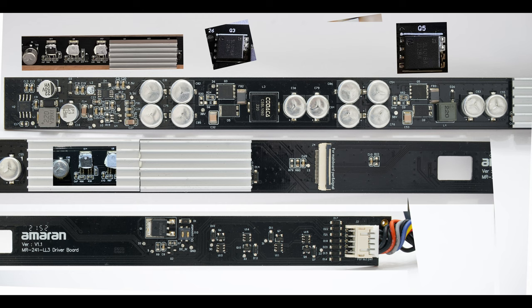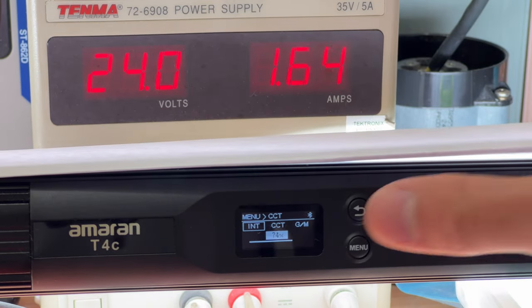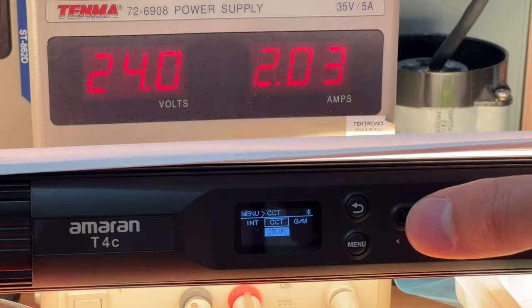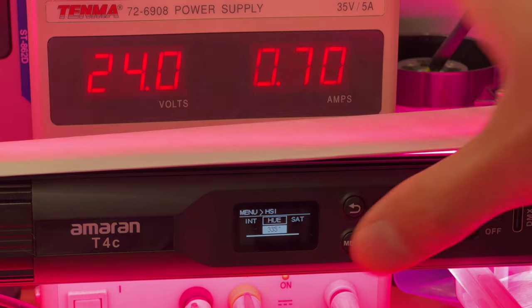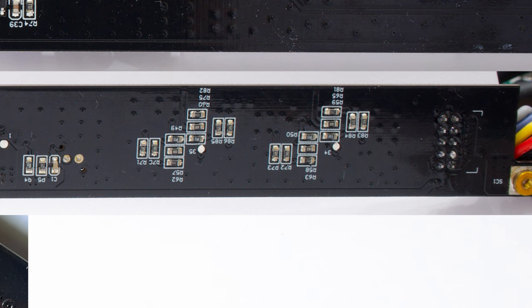The efficiency of the LED driver is poor — close to 80%. At 24V input, the current is 2A. When the light is off, the current is 60mA. The minimum voltage is 13.3V for 4 amps. There is no change in power when the color temperature is changed. With different saturated colors, the maximum current is as shown, and the current increases smoothly when white is mixed into the color. On the back of the PCB, there is a current sensing resistor and current sense amplifier marked 9A2LE, used to detect the input current and help make sure the fixture does not exceed the adapter's power rating by allowing the microcontroller to regulate the output power of each channel. Near the output for the LEDs, there are diodes for protection and some signal processing circuits, estimated to be for reading the temperature of the LEDs.